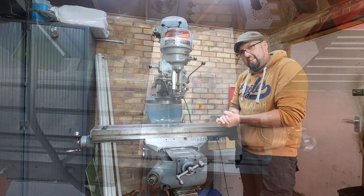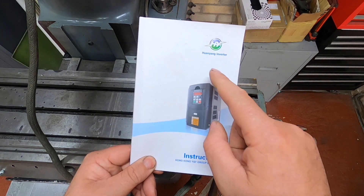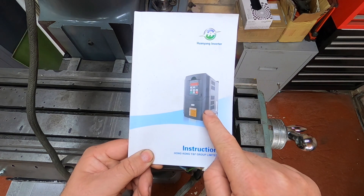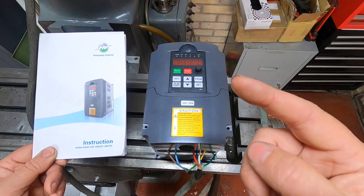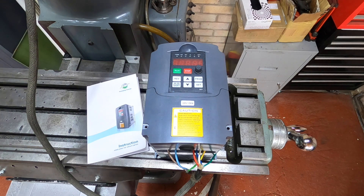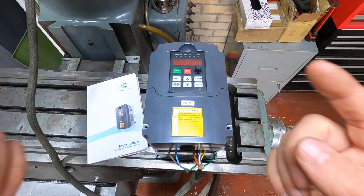So do you want to see it running? How are we going to run this machine? I've bought myself one of these Huanyang inverters, which kind of looks something like this. The motor power on the Bridgeport is a one horsepower motor. Looking around I've seen quite a few conversations on forums about how to power this Bridgeport. What's strange about this Bridgeport is it's three-phase but there are only three wires on the motor. The motor has not been rewound - it is as it came from the factory. After doing a bit of research, this is a good enough inverter to run this machine.